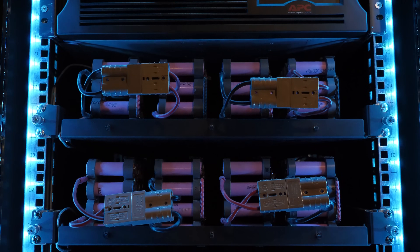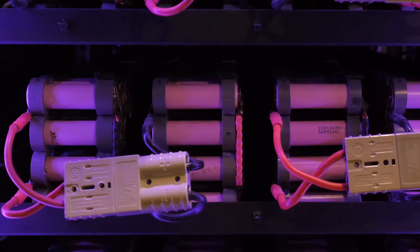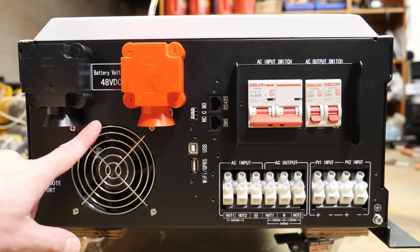I'm going to throw the cover back on and call it a night. The next video will probably be hooking this up to some batteries and doing a test run. My battery is still a little small — I can only output about 100 amps, and the wires off my battery packs are only 10 gauge, so I'll want to stay below that limit. Anyway, next video is hooking up to the battery packs, making sure it works, going through some features, and doing test runs. If you want to see that, hit subscribe and the bell notification. Don't forget to like, comment, and subscribe — see you on the next one.